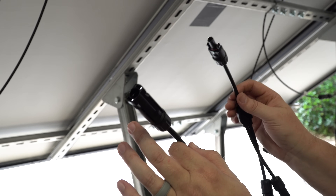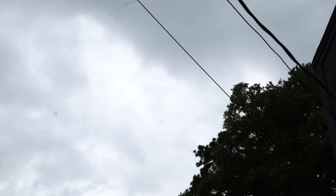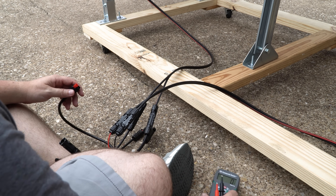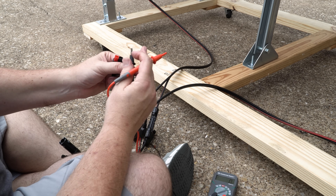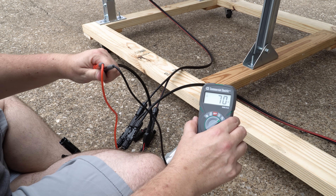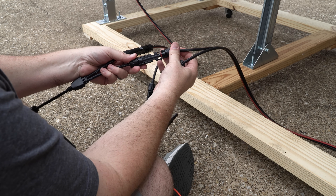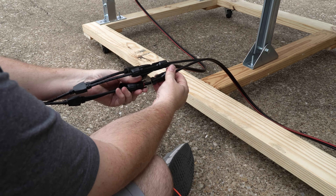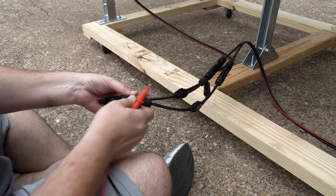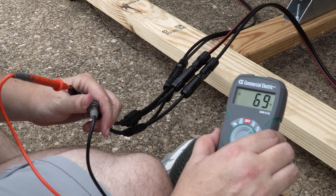Here is my negative feed and here is my positive feed with all 800 watts wired in both series and parallel. I pushed the rack out into the driveway to test on this overcast day. I set the multimeter to DC voltage. One string should be around 70 volts — and it reads 70 volts off one string. With both strings combined in parallel, I'm reading 68-69 volts — right where it needs to be.